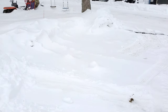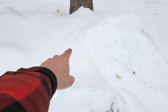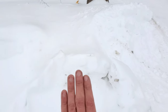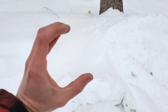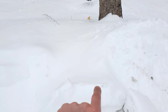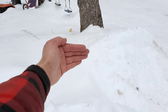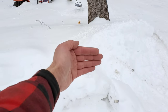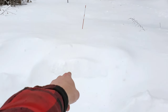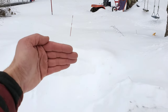That's the other misconception that people have about a snowblower that I'd also like to point out. See, this banking here, this is a snowblower banking into this area. And that started here. It ended up here. Because what happens as you come forward with your snowblower is it's curled. And so in the center of that curl, right in there, if I'm holding it, you end up with a snowpack pushed up against things. So wherever you're pushing up against, it actually builds out that snowpack about 4 to 6 inches every storm. So if you push into this, like that's my stopping point, I'm now back to here with the snowblower. So you got to plan ahead on that. Even with a snowblower, you're going to end up with pushback from building the bank.